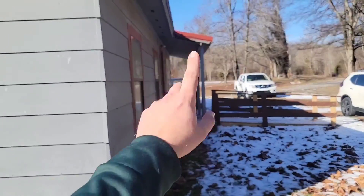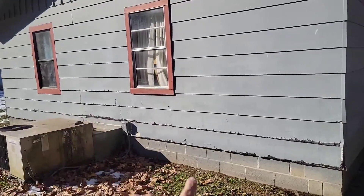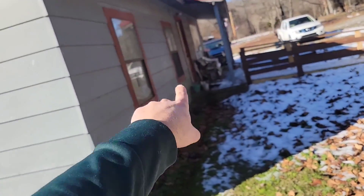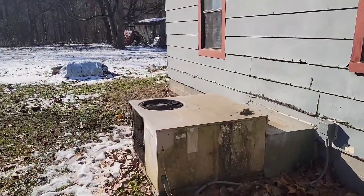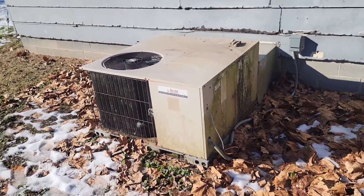I'm going to do two mini split systems on this house because I don't want to run line sets from one side of the house to the other — and the redundancy, I like that as well. One mini split on this side of the house, probably an 18K. On the other side, that would be a single zone. This side would be a multi zone — I'd have three indoor air handlers for the bedrooms. Got one bedroom here, one bedroom there, one bedroom here. I'll put another mini split right here and it'll be a multi zone. That is the plan.